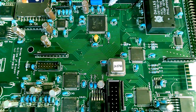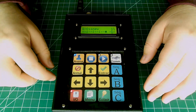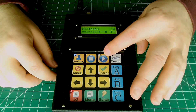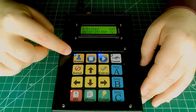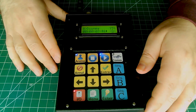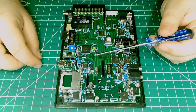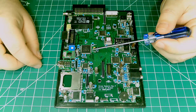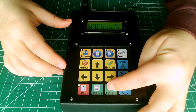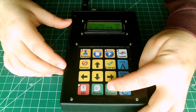One of the first things you can do with a microcontroller is use it to control LEDs, and this project is no exception. You can see a bunch of LEDs on the casing of my Anima Maestro Conductor project. The simplest way to light an LED is to use a GPIO pin that you set to 1 to light it and 0 to turn it off. But you can also use a technique called pulse width modulation, or PWM, to control the intensity of the LED — and that's what I use for this project. We'll talk about it more in future videos.